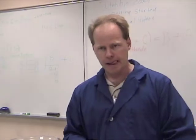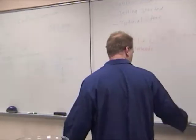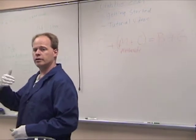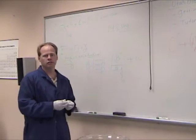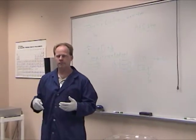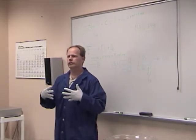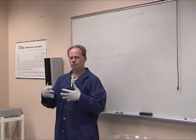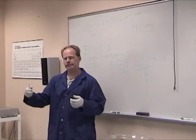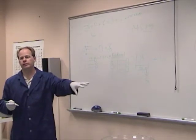So, I have a question for you. What are the dangers in the methoxide when it boils? You say it boils at 148. What kind of danger is involved with that happening? Well, one, methanol fumes aren't good for you, but two, the problem is that there's a certain level of solubility of methanol. Anyone ever made syrup on a stove, poured sugar in water? A better example is putting salt in water. Water can only absorb so much salt, right? Well, methanol can only absorb so much catalyst. If you boil some of that methanol off, some of that catalyst is going to come out. The other problem is that you might not have enough methanol to fully make the reaction go.